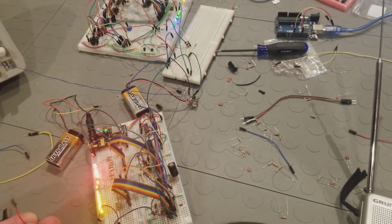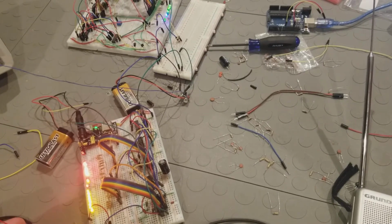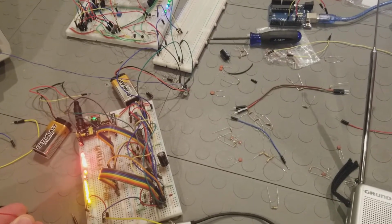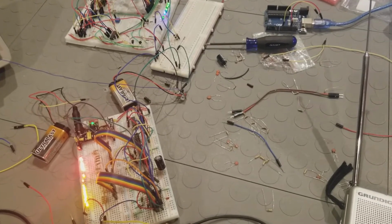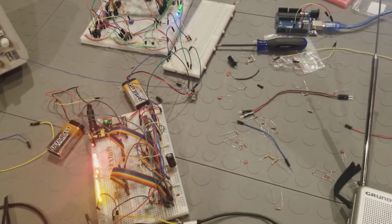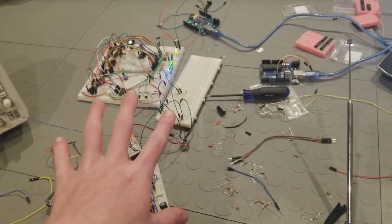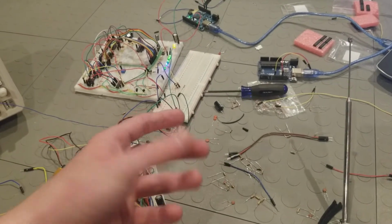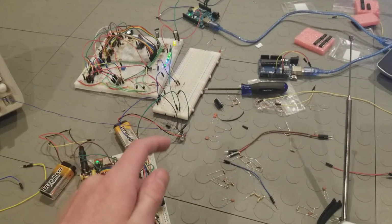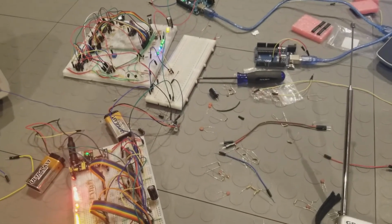900 megahertz of bandwidth, and 5.2 gigahertz can only provide around 520 megahertz of bandwidth. It's really late, so my words are being difficult. Essentially, this system is completely useless, and I'm not going to build a complete prototype of it. Instead, I'm going to have to buy some FPGAs and figure out how to decode an NTSC video signal. And once I've done that, then it should be able to actually make a working system.